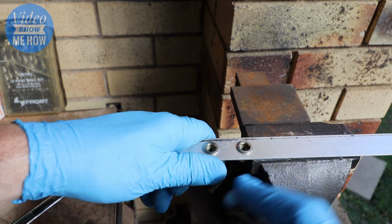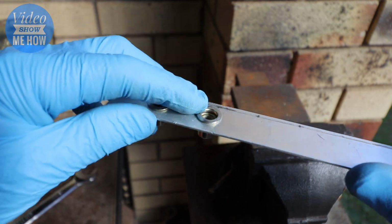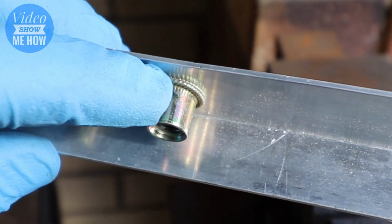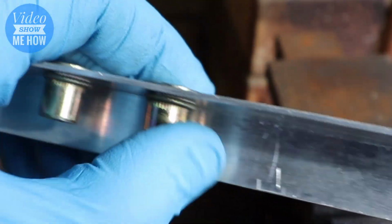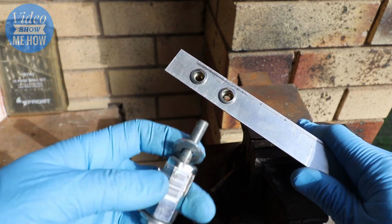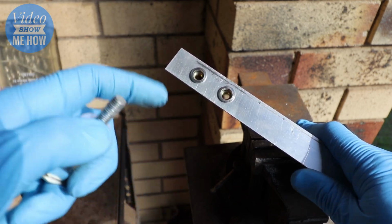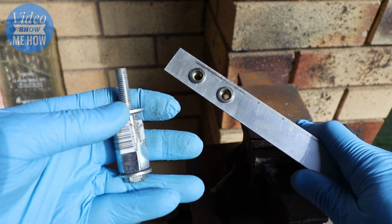And there we are. So if we remove this here, you can see that we have our nice and perfectly installed RivNut. Down on the underneath, you can see that there's a really nice bead showing that it's nice and fully installed. Plenty of strength there and ready to accept our bolt. Now there is an even faster way of using this tool and installing these guys. That's coming up in the next video, so you can click across and check that one out.